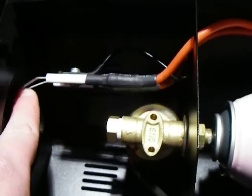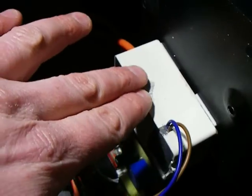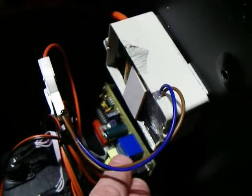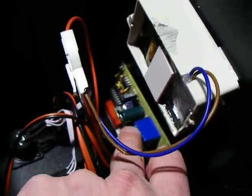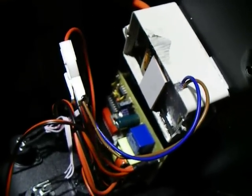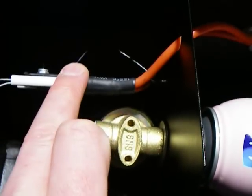The gas then blows past these two electrodes, which a spark is jumping across, and the reason for the spark is because down here is a boiler ignition transformer — an electronic one in this case — and it's turned on at the same time as the solenoid valve. This unit has a DMX facility, so the DMX controls a single relay, and when the relay comes on, it turns on the flame. It's got the manual override, so that's what I've got it set to at the moment. So we've got the DMX, the boiler ignition transformer, the solenoid valve, and the igniter electrodes. Very, very simple. Very pleasing, actually — I like this a lot.